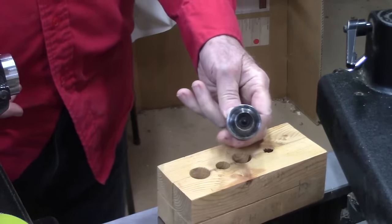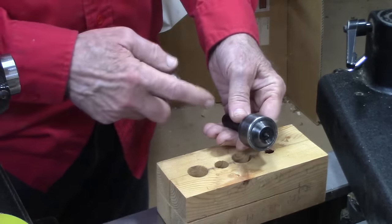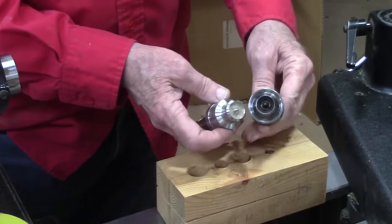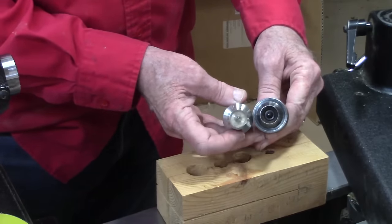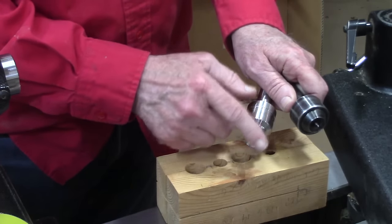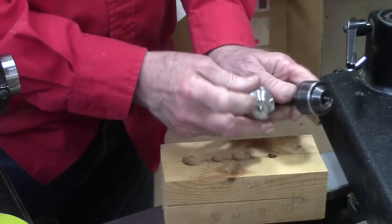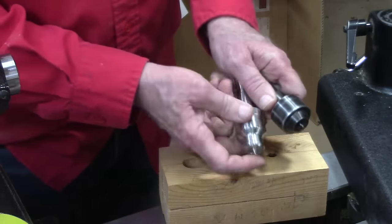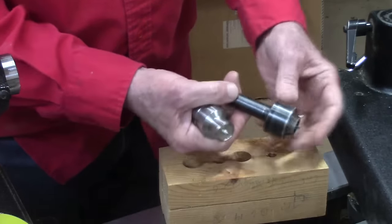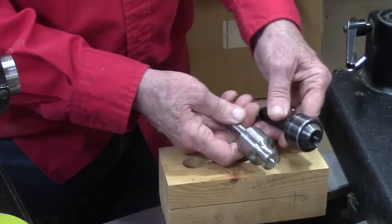My Jet 1014 came with this particular live center. A lot of live centers have many similarities, but sometimes they have differences. For example, this one and this Falcon traditional live center from Record Power are both cup or ring centers of approximately the same size. I prefer this design because it has a standoff — a little easier to get in here. On the other hand, this one has a removable center and this one does not, but this one has two sealed-for-life precision bearings. This one only has one bearing and it's not sealed, so it wouldn't necessarily get the same longevity as this more expensive one from Record Power.